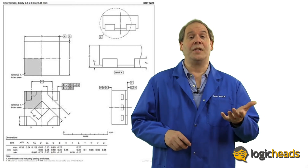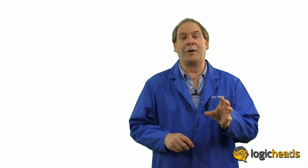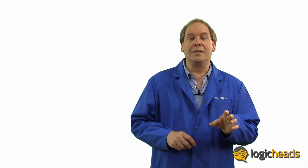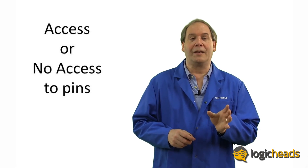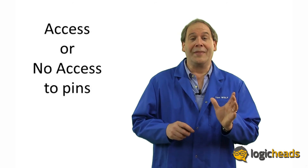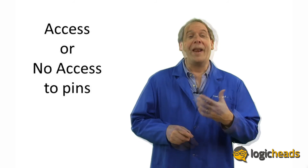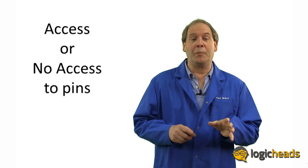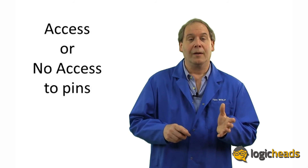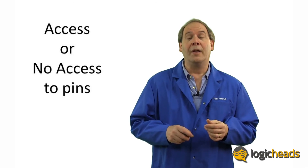It's the tiniest package with the easiest solder pins. So — DIP, TSSOP, BGA, QFN, Micropack, Diamond Pack — besides just the size, how do you know which package to pick? If you can't see the pads hidden under the package, you can't connect to them for test and measurement. So in the lab, this can be a real problem. But out in the field, the lack of accessible pins can actually be an advantage — your competitor can't easily probe the signals on your board. And there are also fewer open contacts to be contaminated by water or metal particles, improving your reliability.